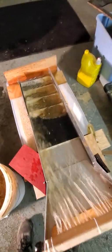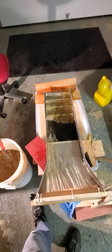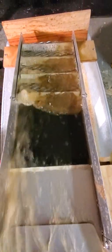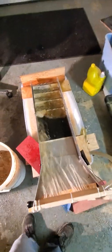I've been running some feed for a bit. You can see it's kind of choking up — it's got some clay balls in it. Those clay balls are a real nuisance in basically any gold ore processing operation. In a high-dollar setup you'd have a two- or three-stage wet crushing circuit and a closed-circuit grinding mill to take care of those ultra-fine particles before they have a chance to clump up in the bucket.